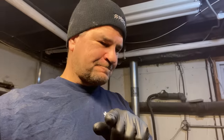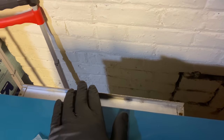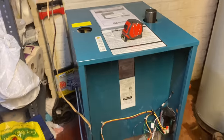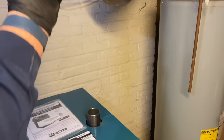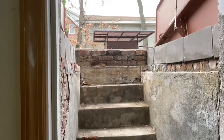Boiler's downstairs — tight, tight, tight staircase. For some reason the Iron Five draft hood that came in the box is not for an Iron Five even though it's labeled Iron Five, so Daniel — mini me, Daniel's son — is going to Ferguson swapping that out. We're coming up on both risers, both tappings on top of the boiler, full 24 inches, elbow out, break down, come across, pick these two up.